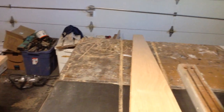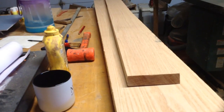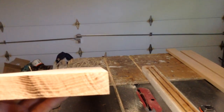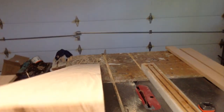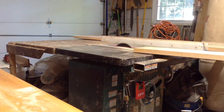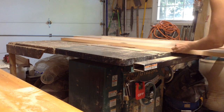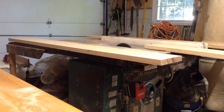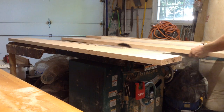You can see this is what it looks like cleaned up. I did this all at once — the big stack — and I'm going to start with the base first. I got this lumber from a really nice source near my old shop because I haven't yet found a newer source where I am. You can see the sides are pretty clean, and I don't have a jointer. When there's not a lot of bowing or cupping — I cannot emphasize enough how unsafe this process would be if there's bowing, cupping, or twists in your boards — but these boards don't have that, and the sides are fairly flat.